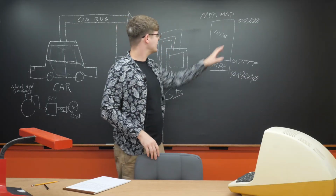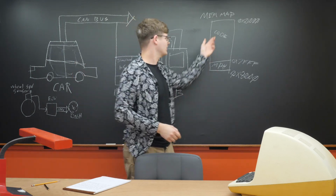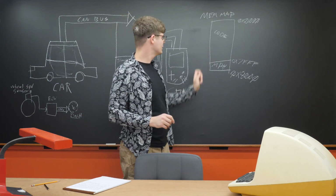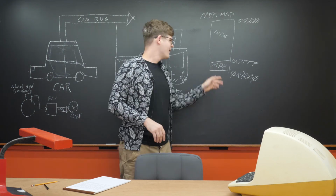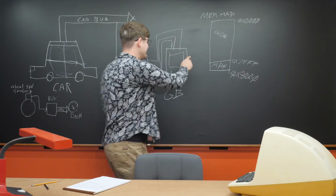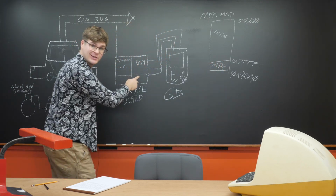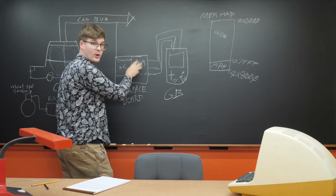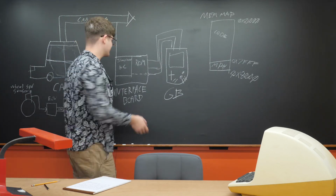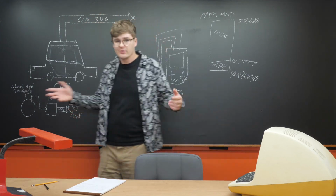Most of the code in the ROM is going to be general housekeeping. It'll tell the Game Boy what to display on the screen and make sure it has a proper boot up procedure and all that. But then every once in a while, the code will read this little segment of the ROM down here. Basically, it thinks this address here is still part of the ROM chip. But when the Game Boy sends over the address data of, hey, I want to read this part of ROM, we'll have some circuitry over here that, instead of sending it the part of the ROM chip, sends it the data that's in the microcontroller. And then the Game Boy reads the speed data off the microcontroller instead of the ROM. Pretty clever, huh? So, just to run things through again one more time.